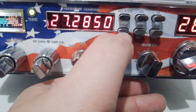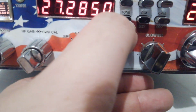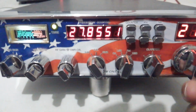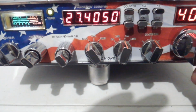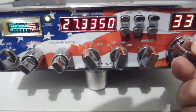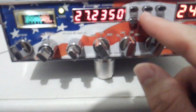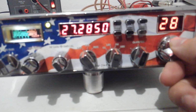I'll show you here. They don't line up exactly because they've been hot shotted in. It's not an official channel kit. It's just a mod. You push that in and now you've got the higher channels, the band above 40 or so, up until channel 32, I believe. Yep, 27.965, and then jumps to 335. With both of these buttons pushed in, the tone button and the dim button, you're on regular 40.